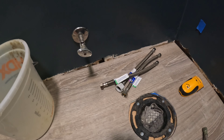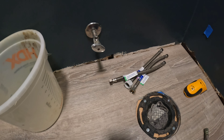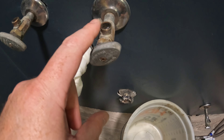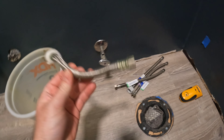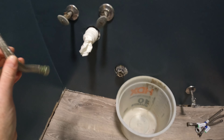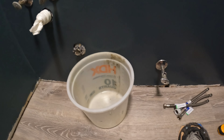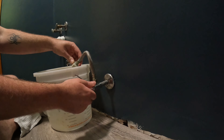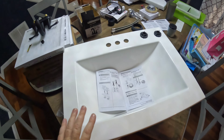I got a new toilet and faucet lines, but before I do any of that, who knows what kind of dirt and debris fell inside all these water connections. So I saved the old toilet line and I'm going to hook that up to all three and flush the lines and fittings into a bucket.